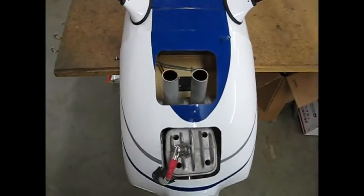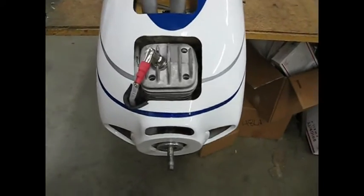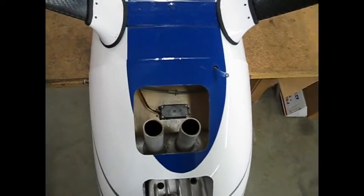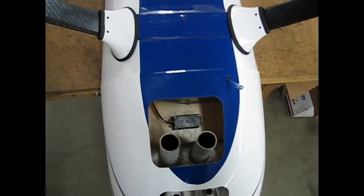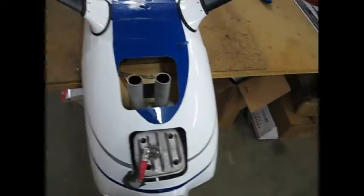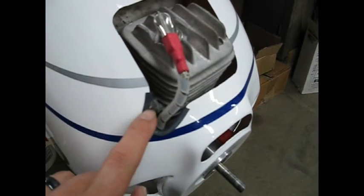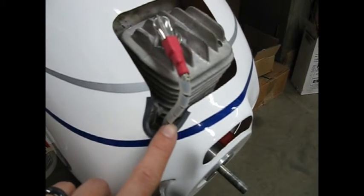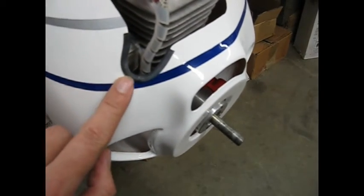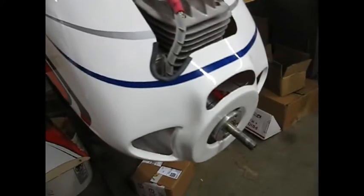I'll give you guys a really nice view of how I cut my cowling out. Note the distance between the lines, the painted lines — you've got to put a pretty big hole in it. The hole in the back looks larger than it probably needs to be, but not only does that help let hot air out of the cowling, I had to cut it that big in order to be able to get it on and off. Don't be afraid to put two decent-sized symmetrical holes in it. I did already fly this airplane, and I did end up having to open this up a little bit more — it started chafing my wire after about two or three flights. I ended up wrapping my wire in electrical tape for the rest of the day, and then opened it up a little further and took some neoprene fuel hose, split it, and glued it around here. We'll give that a try — it's kind of neat looking.